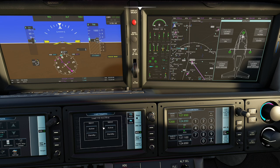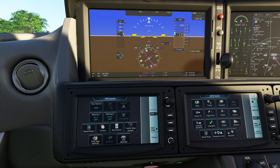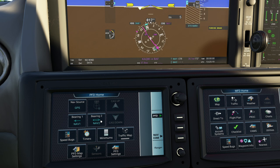The next thing is the PFD controls. The PFD is one of those things that once you set it up, you kind of leave it alone. One thing is you have your navigational source - that would be for VOR1, VOR2, or of course GPS. You also have two bearing options. What they do is they grab whatever VOR you're dialing in and actually point you to it - this little blue needle right now is pointing towards that Chester VOR we just selected. One of the fun things is you can actually do a GPS bearing or an ADF bearing, assuming you can even find an ADF left in the world. Speed bugs is exactly the same as we saw a minute ago.